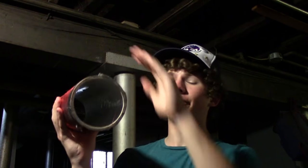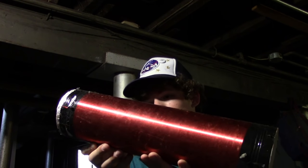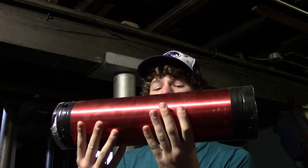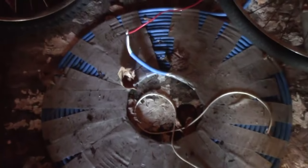On the big coil I put a toroid on top and use a flat spiral primary — it's all duct taped up but it's cool how I did it. This one can produce 2 foot arcs maximum. I also have a special bucket capacitor for it. Under all the junk in the garage is my flat spiral primary — it's literally just an old industrial extension cord pancaked into a coil wound around about 15 to 20 times, and it works very well with the four inch Tesla coil.